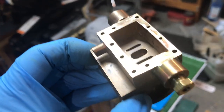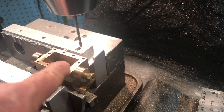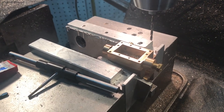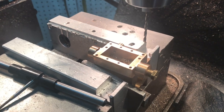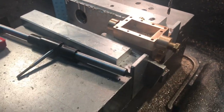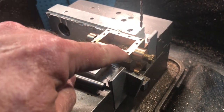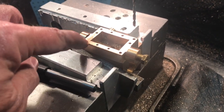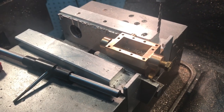I've gone ahead and drilled out all the holes to tapping size using the steam chest as a guide. I tried tapping the holes and putting screws in to hold it down, but that broke the steam chest loose from the cylinder on the opposite one. So I've re-glued it and decided to do this one gently without side forces on the steam chest — and it worked. I've got the tapping size for the 5-40s on all the big holes and for the 3-48s on the little holes. Now I'm going to drill out all these holes to clearance size while the part is set in place.